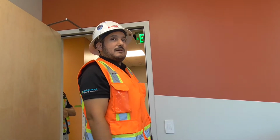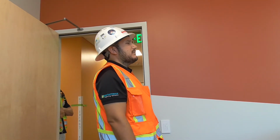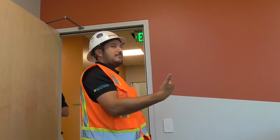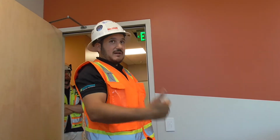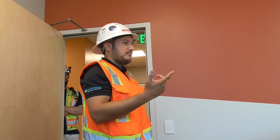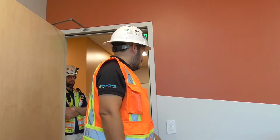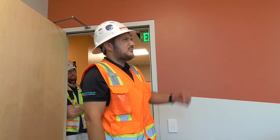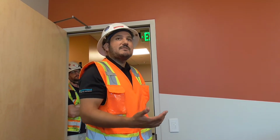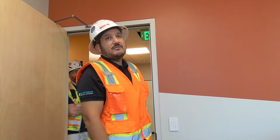Are all switches PoE? Yes. So all these have caps. We were talking about how you have a regular lighting pack that's white, or emergency that's red, and then blue for the outlets, correct. Blue is for the control receptacle. So the red and blue ones do not provide power over the Cat 5. The white one does, and it just goes in here. Each switch and sensor eats about 3 milliamps, and coming out of each port of those white ones, you have 40 milliamps.